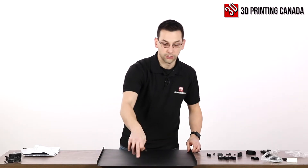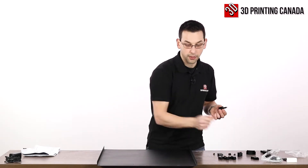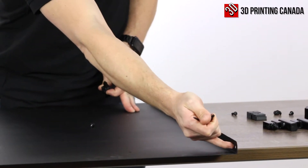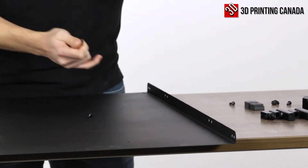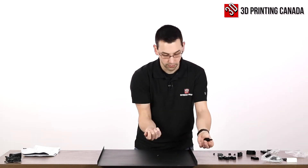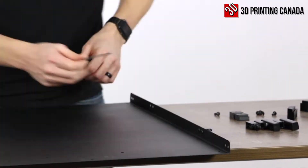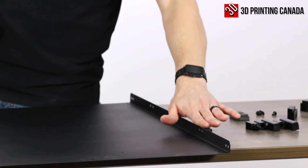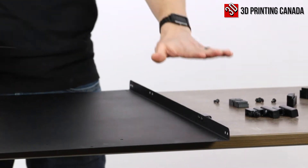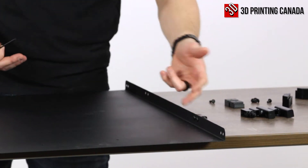I've laid the panel with those three holes furthest away from me. The first thing I'm going to do is attach one of the small parts of these hinges with two of those shorter M5 screws. On the left hand side from the top, there are two holes — we're not going to use those two. The next set of two down are what we're going to use. This little prong is going to face away towards those three triangular holes. I've just pressed down all the way in both holes and bottomed them out, then screwed it on that way, so at least it should be straight. Then do the same down at the bottom — again not using the bottom two holes but the next set up.